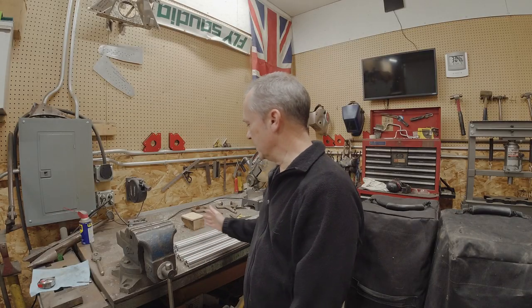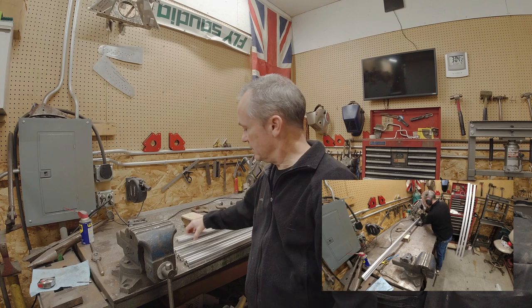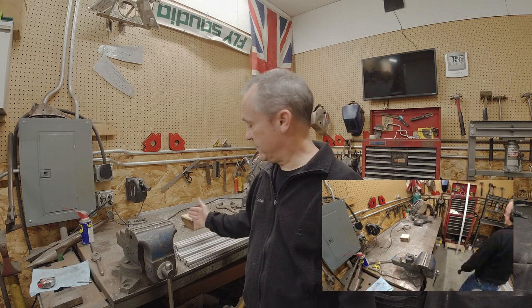To start this project we're going to cut down the aluminum rails, which are the 1020 — meaning one inch by two inch — and we're going to cut them down to 58 inches for the side rails. We're going to have four of these cut down to 58 inches. Then we're going to cut the side pieces to 35 inches, which will make the overall cart 37 inches wide, because we're going to bolt the side pieces between the longer rails we just cut.